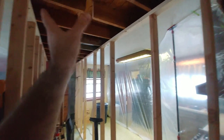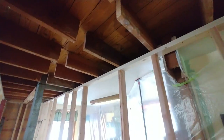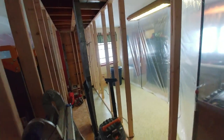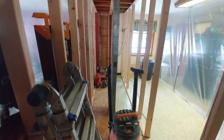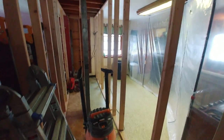Then I can get my measurements and pack in the lumber on this side of the duct. I can take that scab block off once the appropriate support is underneath the beam. That's just a funky part of working by yourself — you have to think along the lines of how to accomplish two-man tasks with one man.